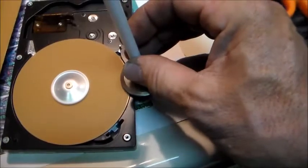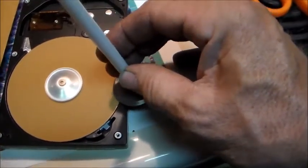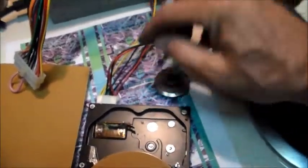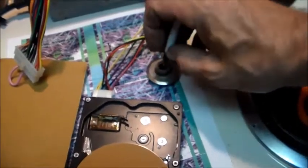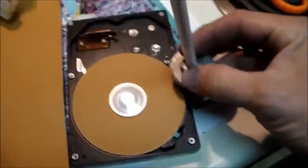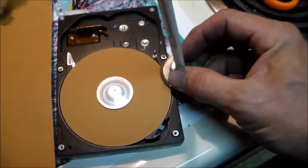You want to be careful — that's really short now. You don't want to cut your cutting wheel oblong, because then it just won't cut properly at all. Hopefully I haven't done that, because a new wheel is about 49 or 50 bucks.